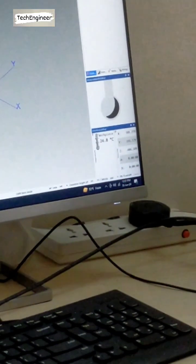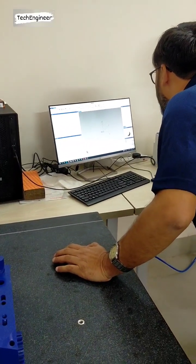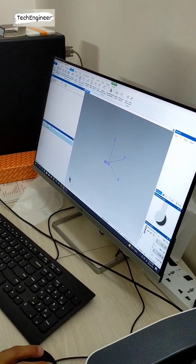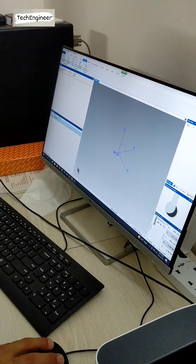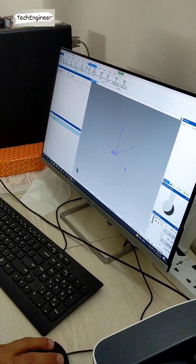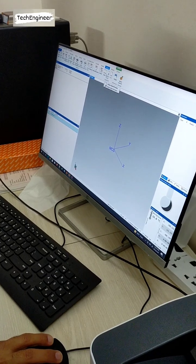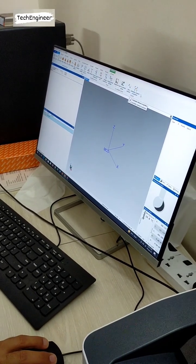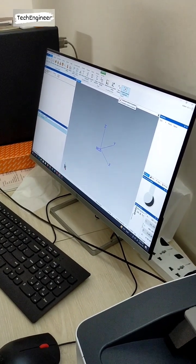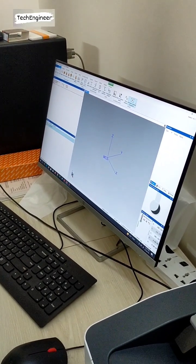Okay, so now you can see a lot of things here. The whole shape is from here, the contour is for the scanning, and that is the machine parameter, manual points, and this is for the probes, this is for the coordinate system, that is the calculation, that is a program, and that is the output. For taking the output, we have to learn all these things first. The main thing is this one. If you understand this, you can measure anything. All the other things are supporting parts. The basic one is this. That all is advanced.